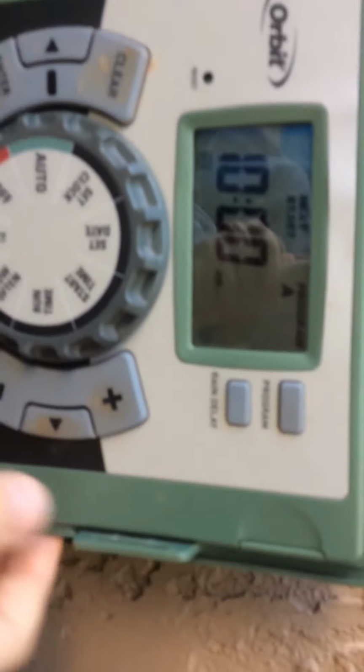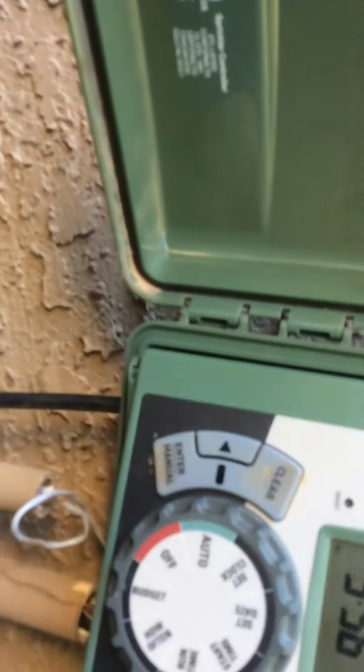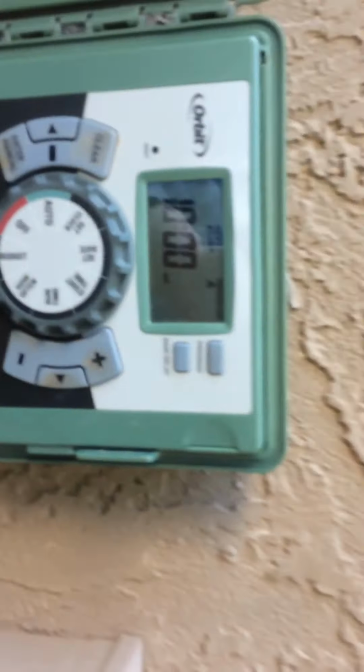So you should be able to open these things up. Panel swings. You also check the condition of the wiring, how many stations. Newer systems tend to have more stations. This one is about 20 years old. You can see a little wear of wires. Looks like we've had a wire replacement or two. This is Orbit control. Most of these are pretty modern. Nothing is a definite teller of the age. This stuff may have been replaced, but new ones also tend to have locks on them. These are some things you can maybe tell.